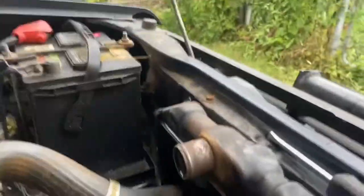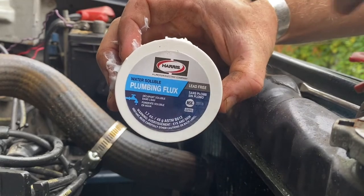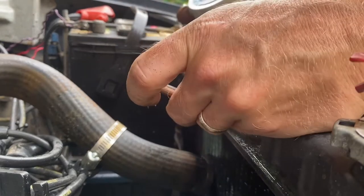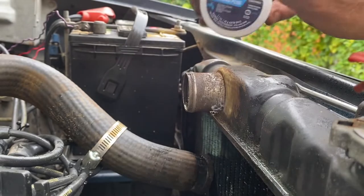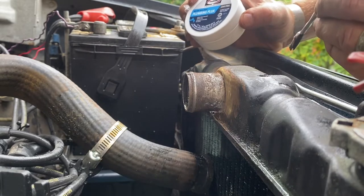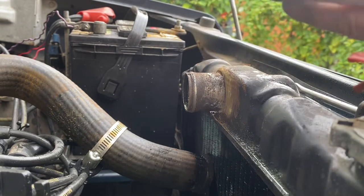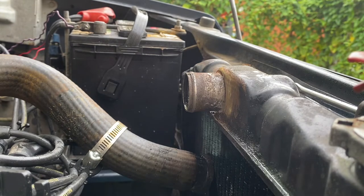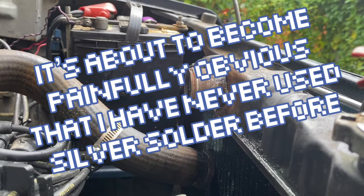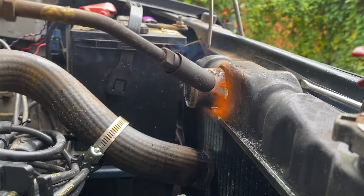I've got this area cleaned up about as good as I'm going to be able to get it. From what I understand, having half-read some of these directions, I'm supposed to take this flux putty and use the tiny brush that comes with the kit to put flux all over the area we want to repair. Usually your electrical solder has flux in it, so this is a whole new world for me to do it separately, but I still understand the concept. Flux applied. Next step is to actually use this silver solder, which apparently contains no lead, so it's safe to drink. We are just supposed to heat this whole thing up and get the solder to melt in there. Apply flux, get flux to sizzle, apply solder — that's what the directions say.